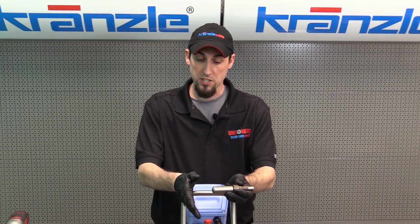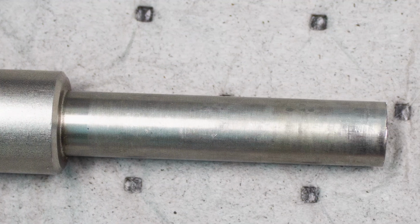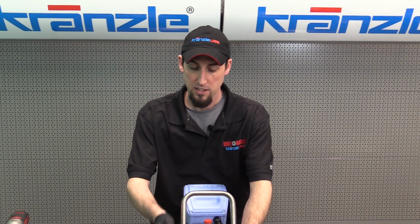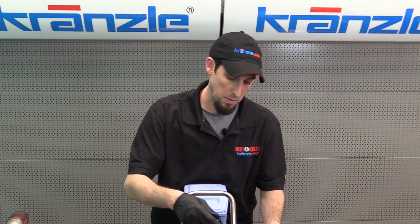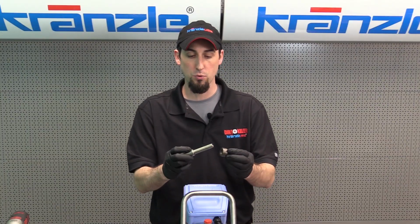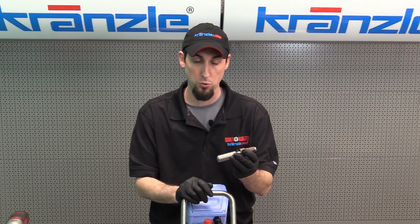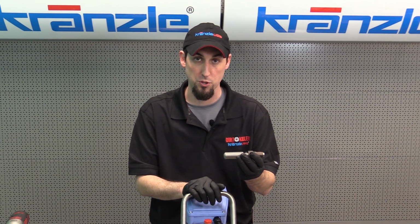For those of you service centers that are watching this video for instruction on how to service a pressure washer pump, you will probably want to invest in this tool for reinstalling the C-clip for the outlet check valve as well as the bypass check valve. The sleeve goes in to help guide the C-clip for the outlet check valve, and then the plunger by itself will be used for installing the C-clip on the bypass check valve. This tool is made by Kranzle and will be available through us, so make sure you ask us about the Kranzle unloader service tool when you get all your components for servicing your Kranzle pumps.